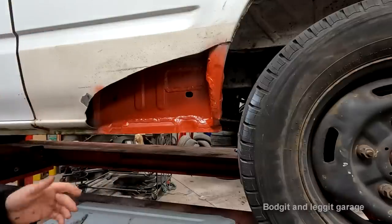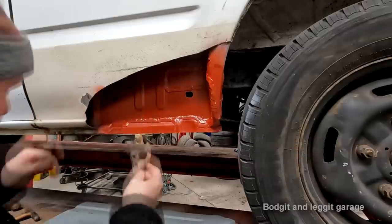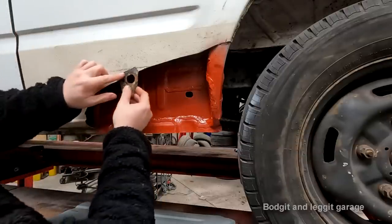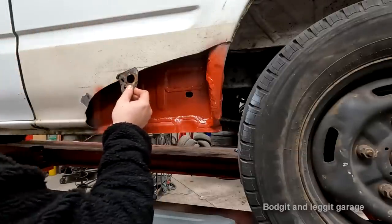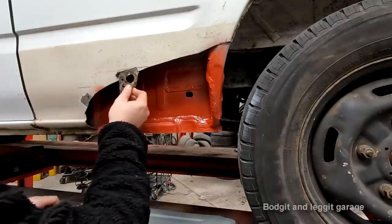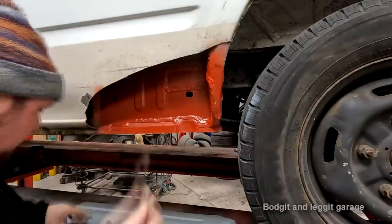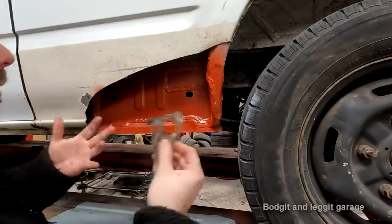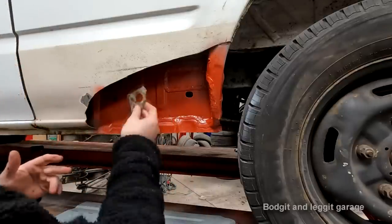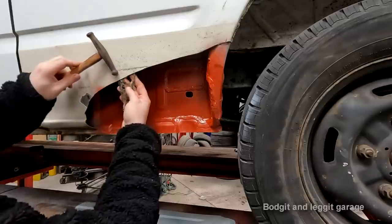So it's like everything. If you do a lap joint like that, imagine the panels on the inside, the water essentially can come down here and rest on there, and all the bits of crap that build up can rest on there and it'll rust out that joint. Yes, I agree. Again, it's going to take a while, but I agree. The lap joint I'm going to do is essentially have the joint at the bottom, so the water just runs off.